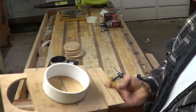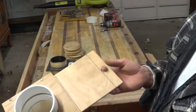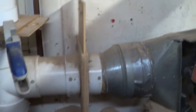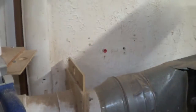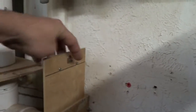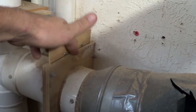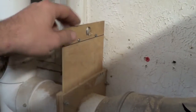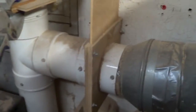It's okay now, but even with humidity it gets tough. You don't want to be fighting with a gate in the middle of a project. Give yourself a little finger catch here to pull it — makes it a little easier, pull it, push it, whatever. For the blast gate over here at the radial saw, I started off with a line to give me a visual of where to stop, but that worked for about a week. Then I put some small screws in right at that line, so the screws hit the top of that housing and you know it's closed or open.